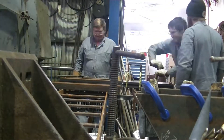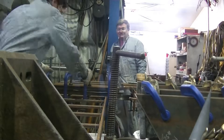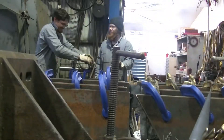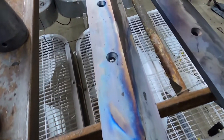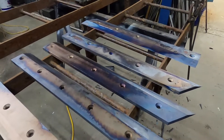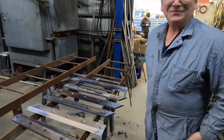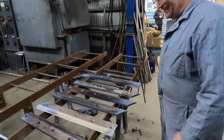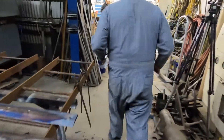The steel we were doing the plate quench hardening with was A2 tool steel, which is a common one. People make knives and tools out of it. It's interesting how you see the little bits of colors — colors come from things in the paper, or from oxygen that leaked in, or a combination of both. When we wrapped these, one of them had gotten torn up and got rewrapped and really looked ugly — but obviously it was the best sealed one. That was the one Austin did, and I was picking on him about it being ugly, but it actually was the best sealed one.